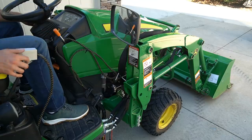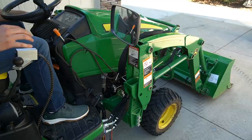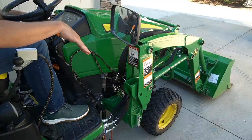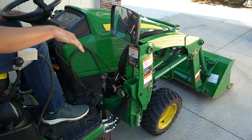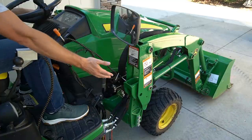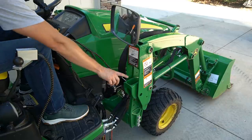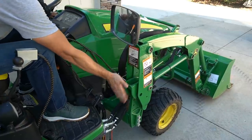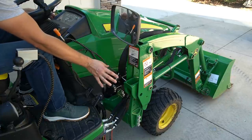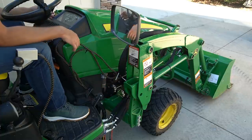You should be able to see the joystick here, this area right here, the tire, and the bucket as well. Those are the four points. We're going to slightly roll our bucket so it almost wants to dump just a little bit, and then push forward like we want to lower the loader down a little bit more. When we do those things, the front tire is almost going to come up off the ground — it definitely does not need to — but the point is to take the pressure off of that front axle. Right now I can't lift up this bracket here. It's a spring-loaded bracket, it's in place, and there's an identical one on the other side. When you can lift this one up, you can also lift the other one up.